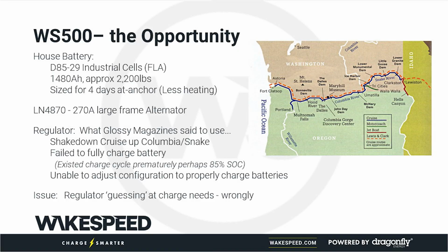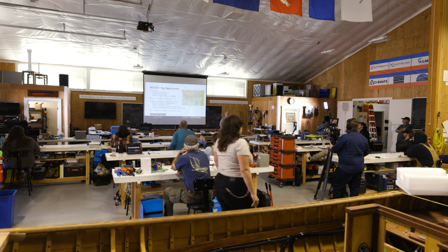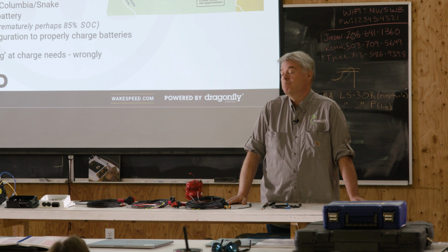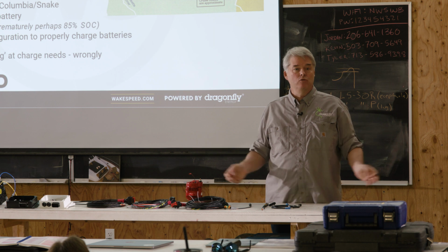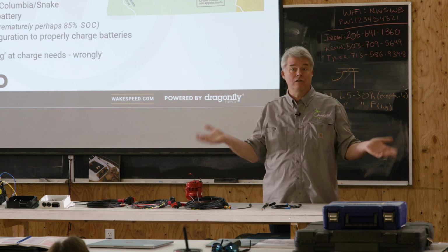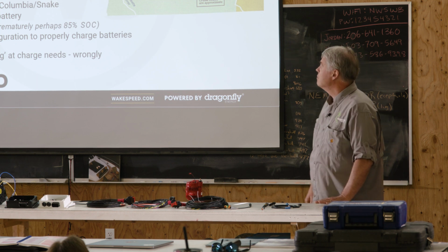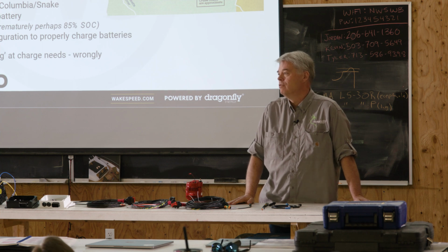During that cruise, we were 6 weeks away from the dock, is when I, as a retired EE and CE, figured out that that glossy magazine thing I had installed, sold to me by a really good marketing guy, didn't work. We probably had a slightly more demanding need. We had large batteries. We depended on those batteries. We were away from the docks for long periods of time, but it would chronically undercharge the batteries. It would enter float mode when the batteries were at about 85% state of charge.